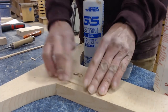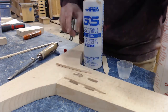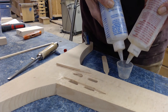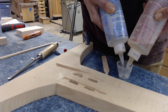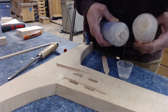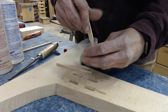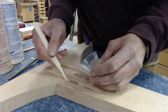Let's try the fit. Yeah, that's pretty good. I'll have some follow-up to do to disguise the lines — that'll be done with pigmented fillers. Epoxy is what's called for in this particular glue operation, because it does not shrink. It has two compounds that combine — one is a catalyst that hardens the other, so nothing evaporates; they just combine with one another. If I were to use ordinary yellow glue here, because the bottom isn't perfectly even, there will be voids between the bottom of my piece and that, and they would probably not remain filled because it shrinks.